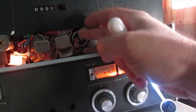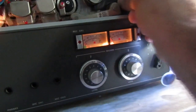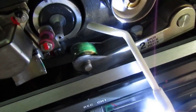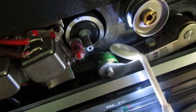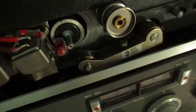The motor seems to be turning fine. Okay. So, our biggest problem now is the pinch roller. I don't know if you can see it. I've heard of some pinch roller turning to goo, polyurethane pinch rollers. And this is probably what has happened to this one too. So we will have to find a solution for the pinch roller first, and then we can go on to other repairs if necessary. Okay, that's it for today.